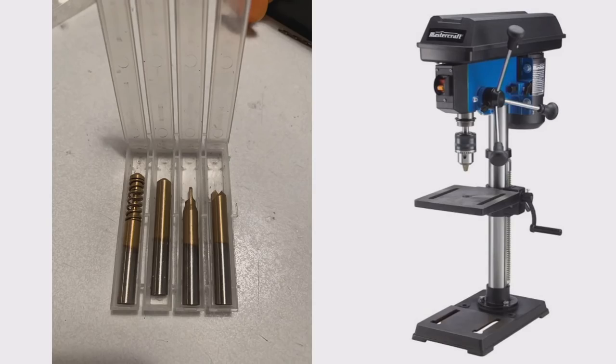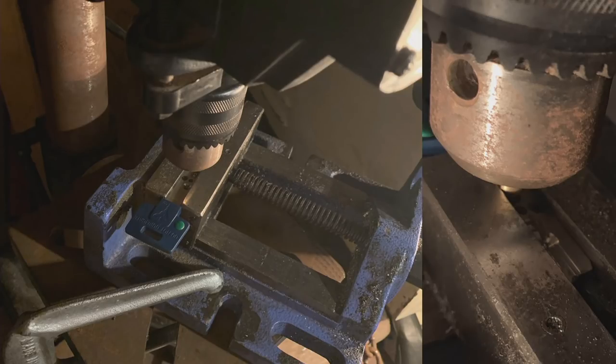We went ahead and figured out a way to duplicate a multi-lock on a standard drill press. So you can buy these multi-lock cutting bits online for about $20, and many people have a drill press, if not, a hackerspace surely will. The first thing we do is take the key we want to copy and put it in our vise, and we index on the cutting head where exactly that key should be placed by putting the vise at the right position, and index how deep the drill should go. You can set that once it's at the right depth so it'll only drill to that depth. And we can go ahead and use a common drill press to copy a multi-lock key.